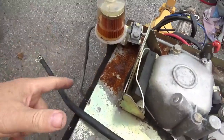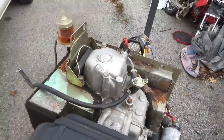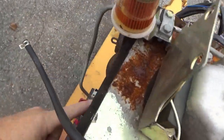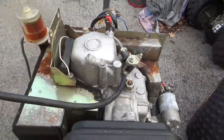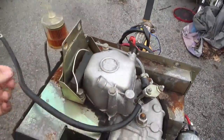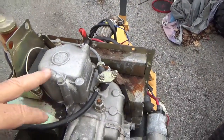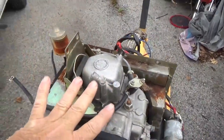You need a constant flow. What I'm going to do with this video is show you how to bleed the air out. When I first tried to start this motor up I was hoping the fuel was continuous right down — it was not, so it didn't start. Also notice this extra line — that's a return line. If you don't put something at the end of this return line it's going to dump fuel all over your driveway, make your wife cranky, and everybody's gonna be mad at you.